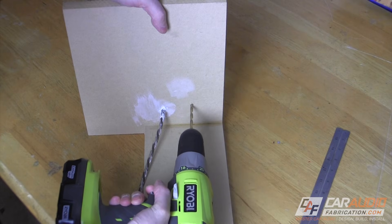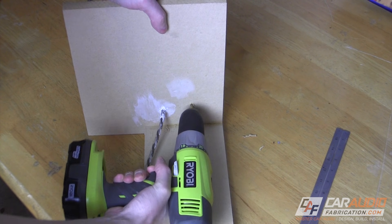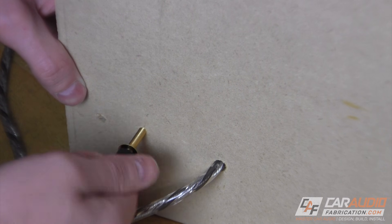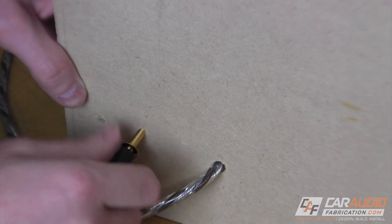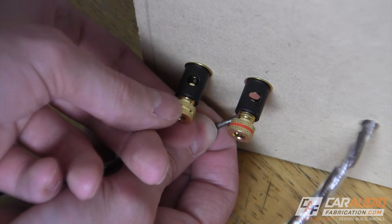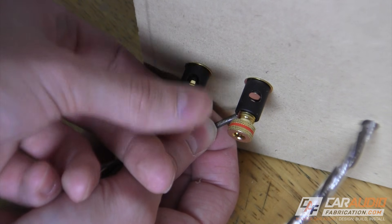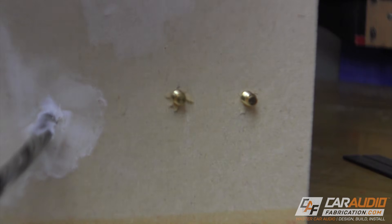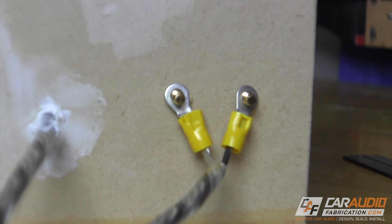Thanks to the Patreon supporters, I was actually able to pick up these binding posts to make this video. For binding post style connections, you start by drilling a small hole — small enough that you literally have to thread the binding post through it. With threading it in this way, you know that it's good and sealed. In both of these cases you are making a hole in the box, but it's not so large that you're sacrificing any strength, and you don't have to worry about plastic vibration.